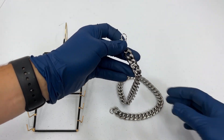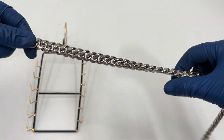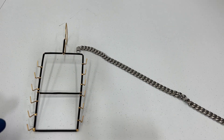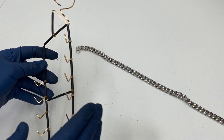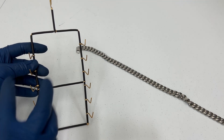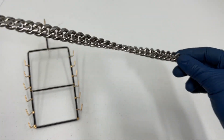This is a heavier chain, as you can see, and it has good connections in between each of the links. The thing with chains is you want to make sure every link is touching each other. To do that, we're going to be putting it on this necklace rack, which should be on our website, and we're going to make it tight on each one of these racks so it makes a good proper connection and all of them should plate without a problem.